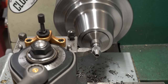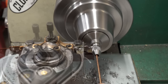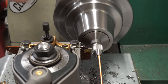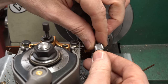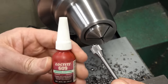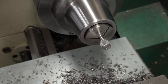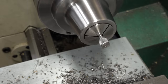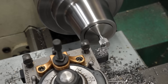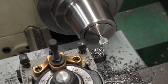Before cutting the part all the way off, I'll come back with a 60 degree threading tool and put some chamfers on here - a chamfer on the cylindrical end next to the cut, and then try to put a tiny little chamfer on the edge of the knurled section. This is a little bit fiddly because I want to chamfer the knurl but I don't want to gouge the part. I can hear it more than I can see it and that should be good enough. Now we'll just come back with the parting tool and finish cutting off the part. To face the end I don't have a good way to hold it at the moment, so I cleaned all the oil out of the hole and glued the part onto the end of the handle with Loctite 609. Since it was a slip fit, this stuff should work pretty well - it's had about 30 minutes to set up. The shaft is pretty narrow so I'll choke up as much as I can, take light cuts, and we should be okay as long as the adhesive has set up enough.